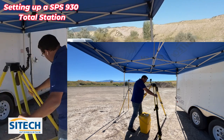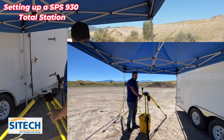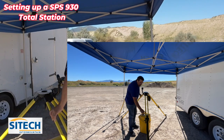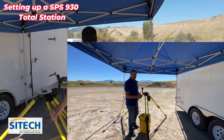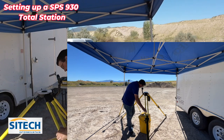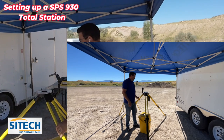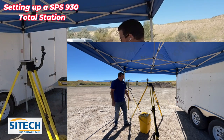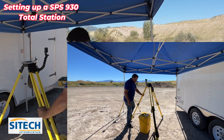The other problem is making the legs too far out. If you do it like this, there's more chance of kicking out if you're not kicked into dirt or anything else. I've also found that when the legs get spread out like this, if you're around rollers or dozers or equipment on the job site, the vibration — even vibration from wind — will actually make these legs bounce a little bit. And these instruments are so accurate that it will actually show up inside. So I just find kind of a nice widespread — not all the way out, not too straight up and down — and make sure those legs are kicked in really, really tight.